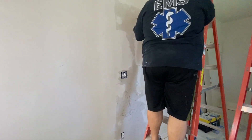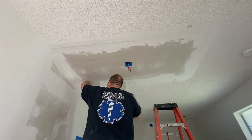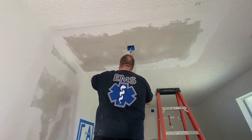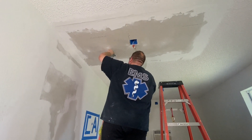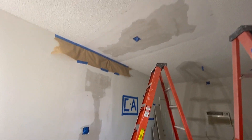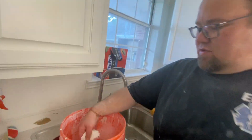There's a gap here on this wall that we had to fill in — it's uneven because they built this stupidly to begin with. He's doing it up here on the ceiling because there's a big gap up there too. Once we do this we can sand it, even it out, and hopefully texture it today. The drywall is uneven even though it's the same level of drywall — that's not us though, that was the people who built the house. The studs weren't placed right, there's almost a quarter-inch gap. Anyway, we're about to the point where we're doing texture. We're going to mix it with water and spray the popcorn ceiling. It looks like flour but it's not — it's a little lumpy because of the popcorn. Popcorn ceilings are from the 70s and 80s; this house was made in the 90s but it's still a popcorn ceiling.